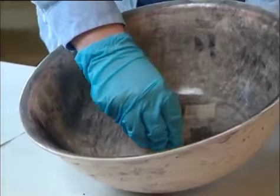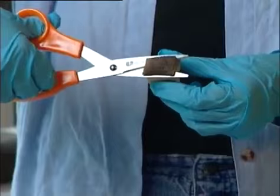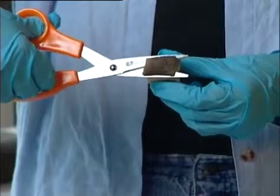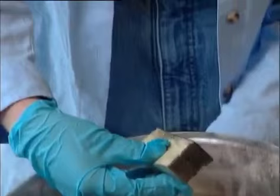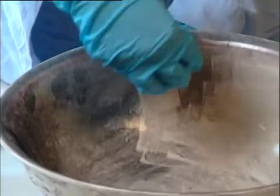A soot sponge, which you can buy at major hardware stores, is unlike a regular sponge — it's not for wiping surfaces, and you use it dry. You lay it carefully on the area you want to clean, press gently, then pick it up. You'll have a layer of soot and ash on that surface, so you can't use it again. You either need to cut it off or turn the sponge and use another edge, slicing off the outer perimeter and continuing until you've finished cleaning. Eventually the sponge will be tiny, and you'll start with a new one.